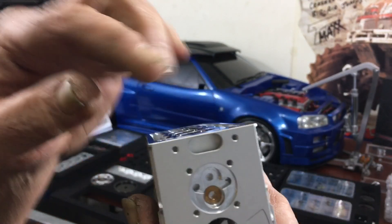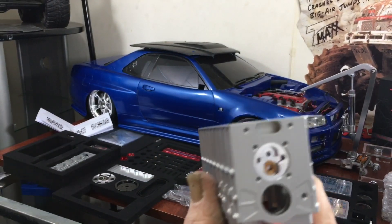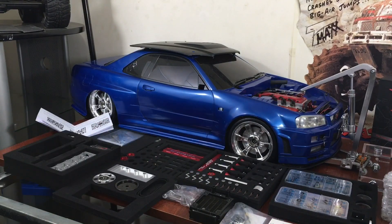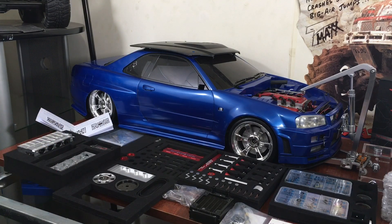Put a little grease on the belt tensioner and work it back and forth to make sure it fits nice before final assembly — after I got mine together it was jammed and I had to take it all apart again. You want to avoid taking stuff back apart after you have it together. Once you put something together with Loctite, you generally shouldn't have to tear it down again unless it's a full rebuild.